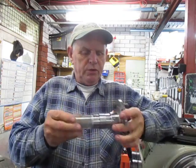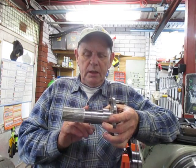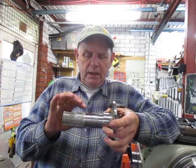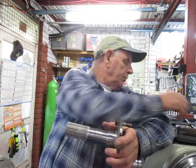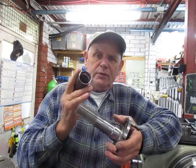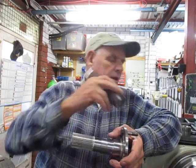The next thing we did was the shafts — the original bearing sat in this area here on the journal. We machined the larger diameter down to the size of the bearing, and then we made a bush. Answering the question: this shaft is very, very hard, but the bush is made out of a piece of steel pipe, and I machined it and pressed it on here.